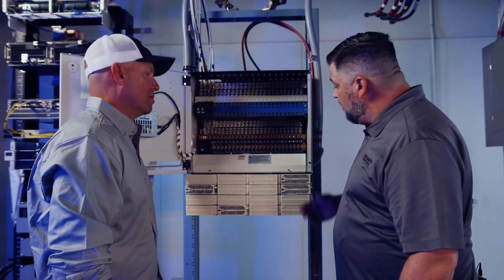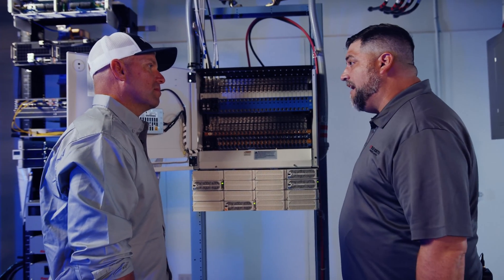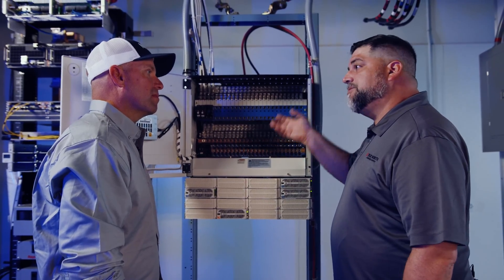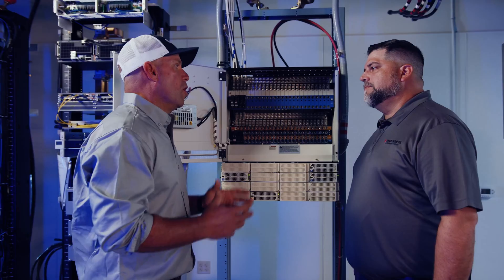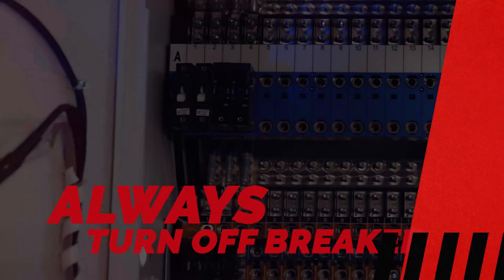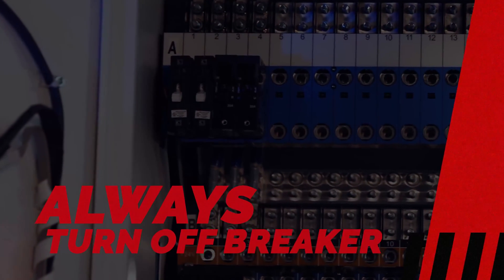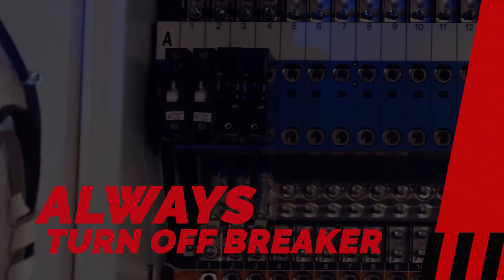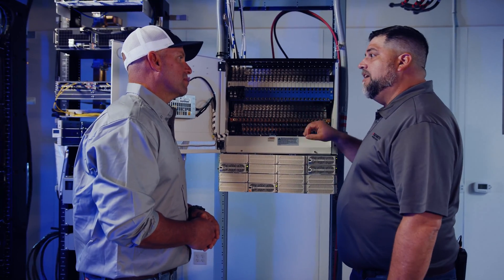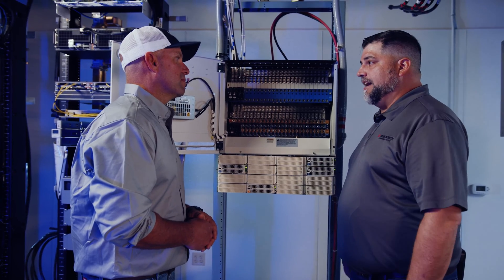And what do the rectifiers do? Well, the rectifiers are actually connected to the AC power panel on the wall. The AC power comes into the back of the rectifier and it's converted to DC power, then sent to the breakers to power the equipment on the tower. So if the crew is changing out an RRU up top, what does the ground guy need to do? It's very important that you cut the breaker off first and foremost. Anytime you're working on live equipment, you want to turn the breaker off so there's no risk of electrocution. It's also important that you lock out tag out if necessary.